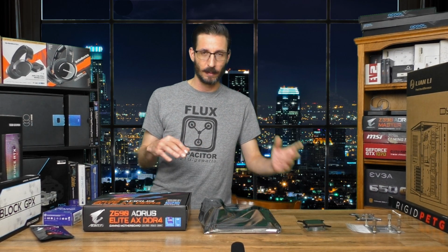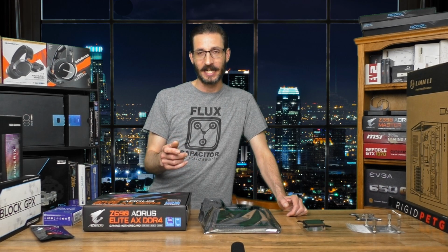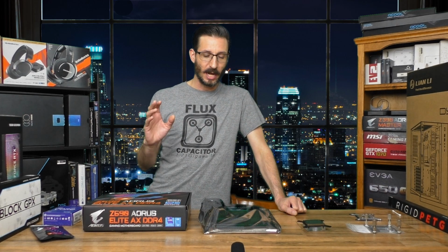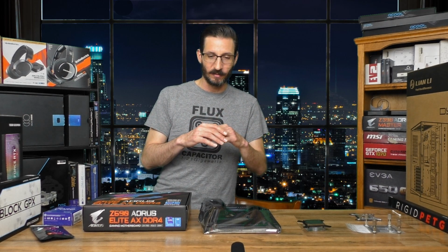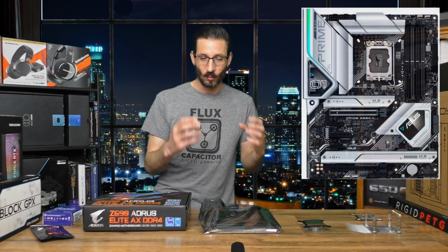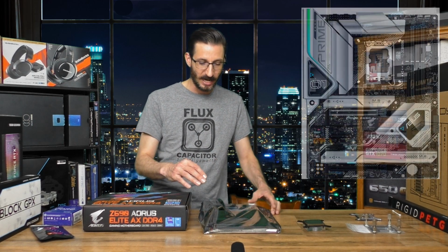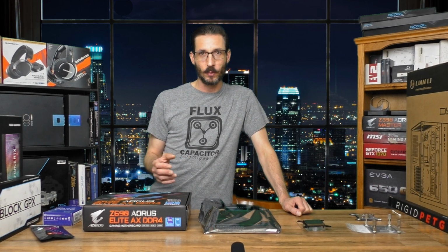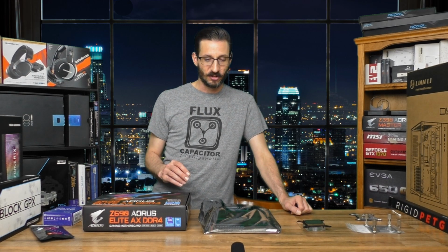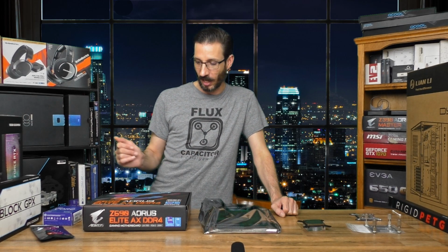You know, it's water cooled. We want to see how far we can push the limits. We really actually liked the Asus Prime Z690-A. It's the same price as this motherboard, and it was the same kind of across the board. We really wanted that one to work out for this build because it would match the case better, the color coordination. But when it came down to it, the VRM supporting the CPU just wasn't there in comparison to Gigabyte's Aorus lineup, specifically the Elite.